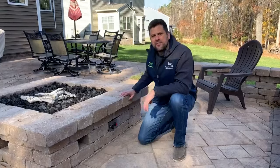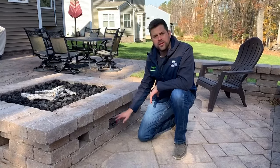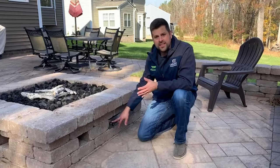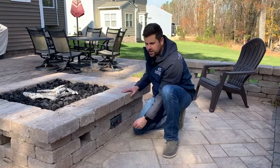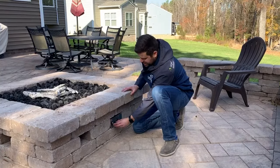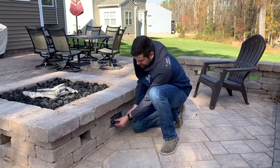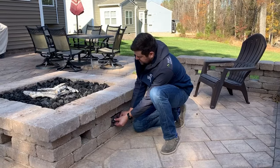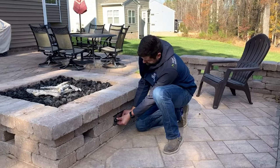While looking online for some videos to send to a client about how to start an outdoor gas fire pit, I couldn't find anything, so I thought I'd make a video for you. So what you're going to do is turn the knob on. You'll be able to hear the gas, and you're going to push it all the way in, and then push the button.